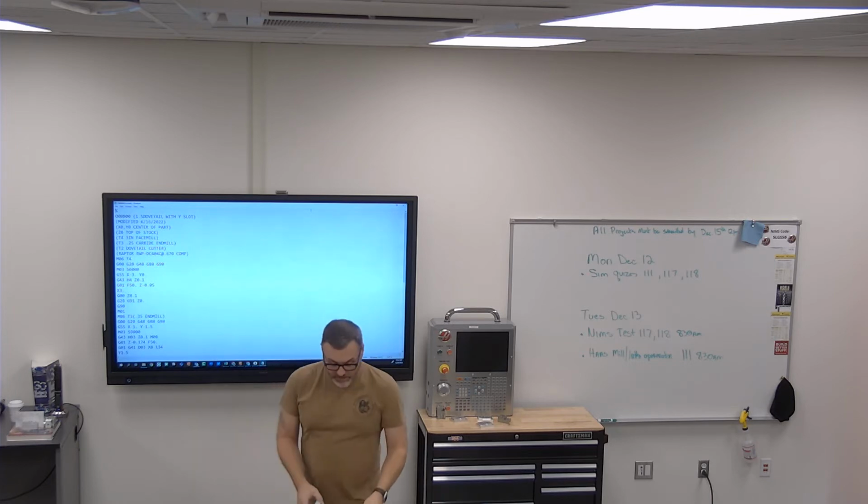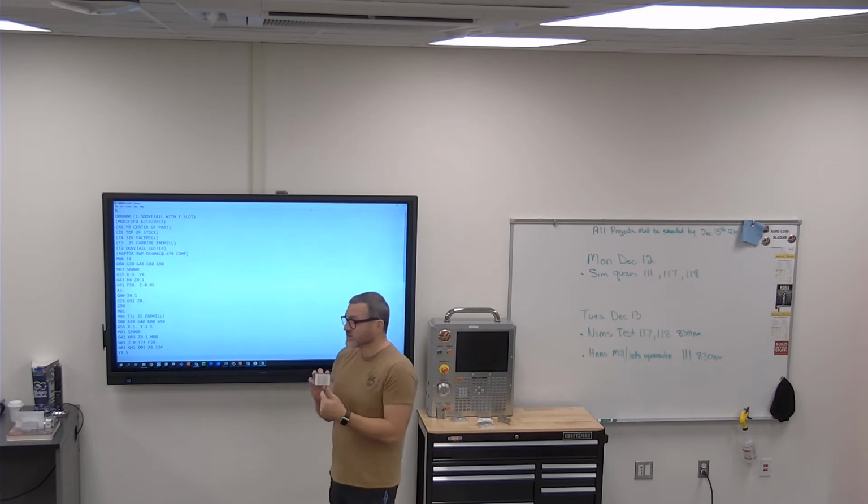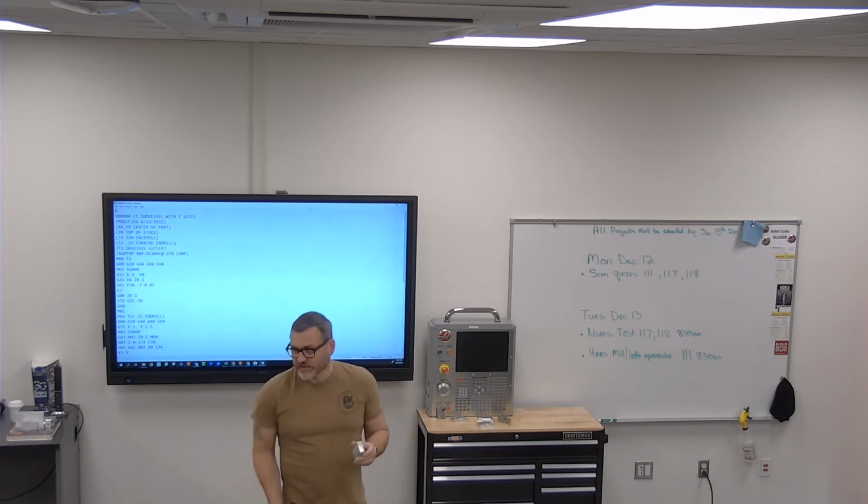So now the 1/4 inch end mill is going to come through here. You're going to set normal cutter compensation for it. 1/4 inch end mill, regular, you'll just do your regular diameter compensation for that. So you'll just put in the diameter. Not all dovetails will have this Y-axis slot that goes through it.